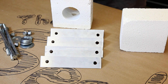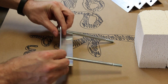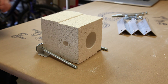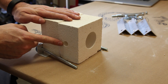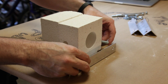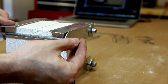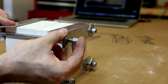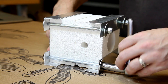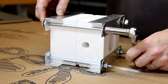Now it's time to assemble all the pieces. Take the aluminum sections and run the bolts through them with washers, then place them on the bricks. Be sure that the side hole we drilled is situated on the left side towards the center of the bricks, then install the next section of aluminum angle. Go ahead and install the top straps along with the fender washers and nylon lock nuts, and hand tighten them. Using a half-inch socket wrench, tighten up the straps — we want them secure, but do not over-tighten, as doing so could fracture the bricks.